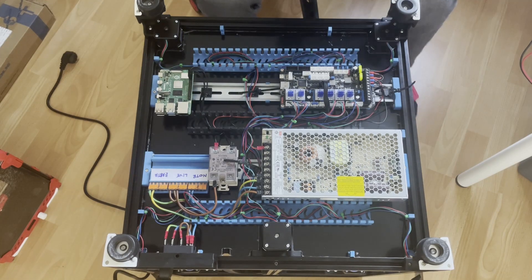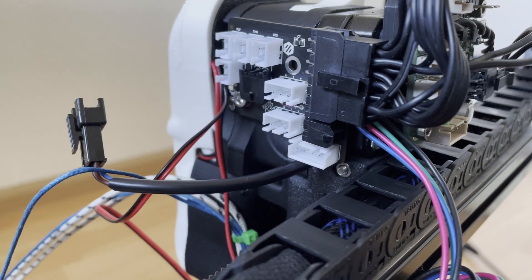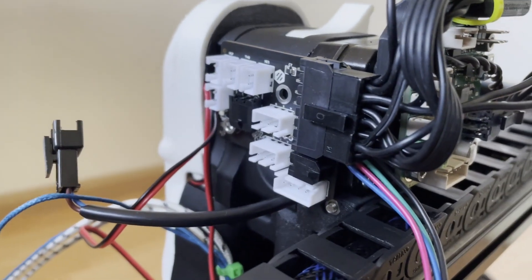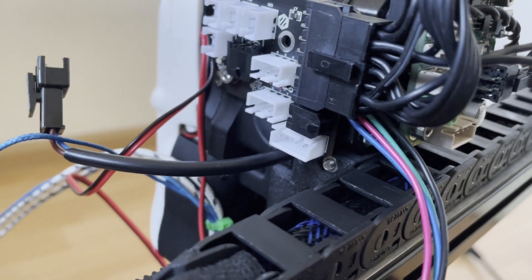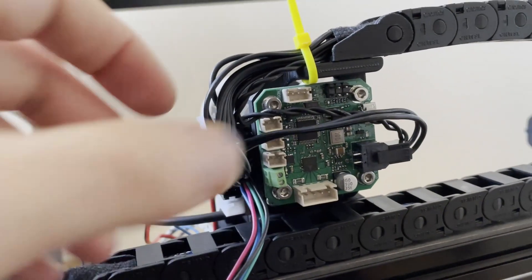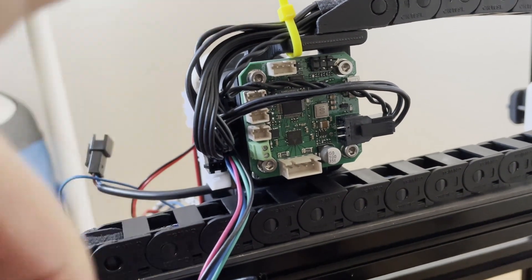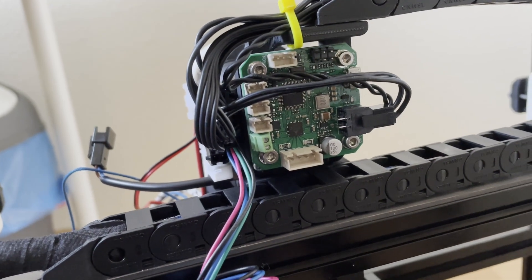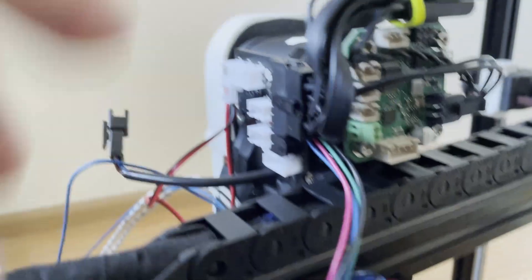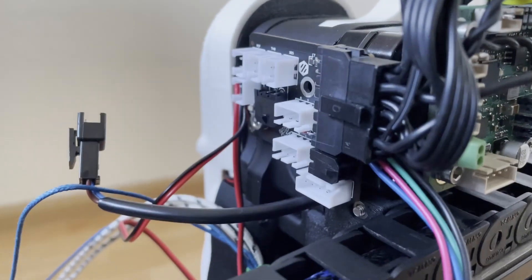I am using the Hood board. I also put the tool head board. Before I found the Hood board I was planning to use a PCB breadboard and prepared everything for that. After getting the Hood board I found there are no extra pins for a thermistor or lights for the Stealthburner, so I decided to use both boards together since they don't interfere with each other.